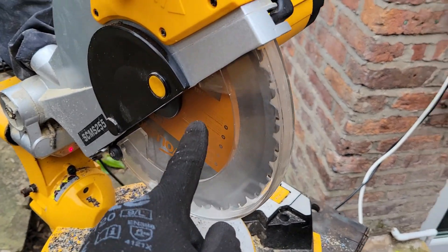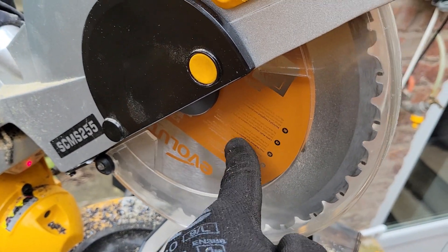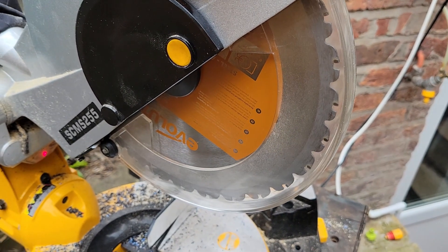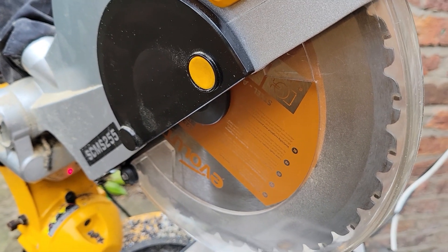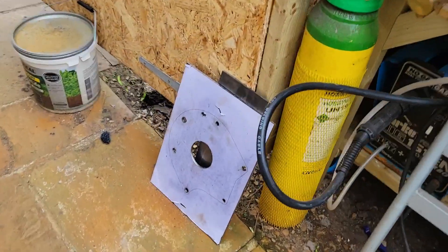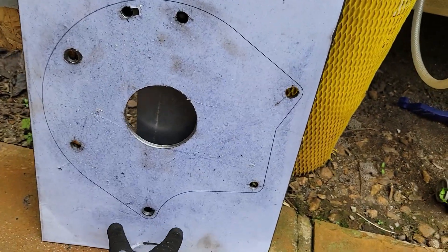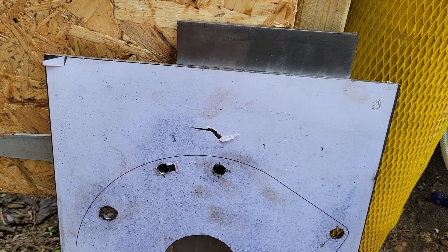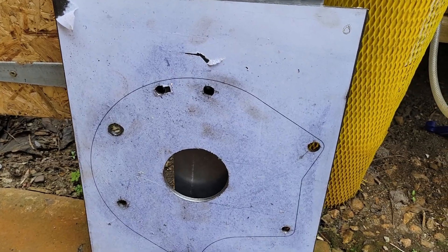It's a little thing — I've modded my JCB saw to take a Rage Evolution blade. I thought about buying a whole new saw for metal, but these blades can cut anything, so I might as well just mod it slightly. I just had to turn down this collar slightly to fit through the smaller centre diameter on this blade — that just took two seconds in the lathe and that's now a nice fit. And I've used that to trim down the motor side adapter plate, keeping enough material on each side to attach the arms which will come off and go to the motor mounts.